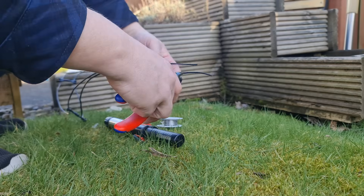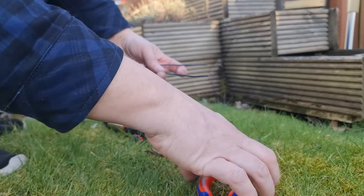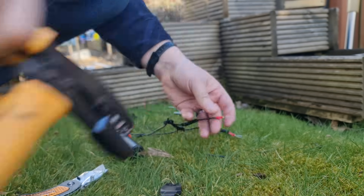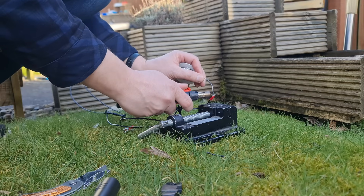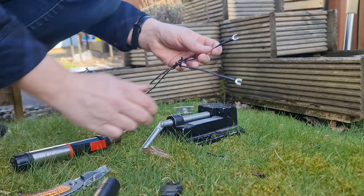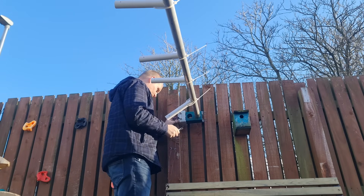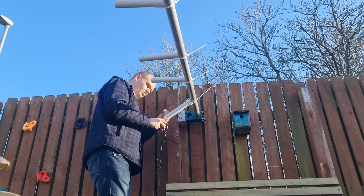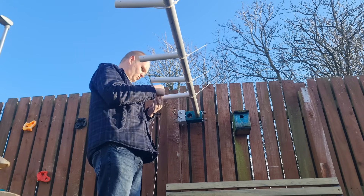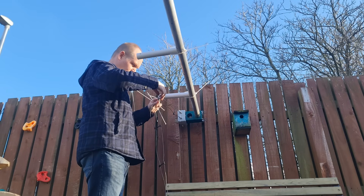Here's that open wire feeder. I just even one end off. I need to put ring connectors on it — crimp them on, and I also solder them using the flame for quickness, finished off with some glue-lined heat shrink, so that'll give it some nice weatherproofing. Using a 10mm spanner, connecting up our feeder. This took a little while — I think it took over an hour to get this run down the pole doing it for the first time. Certainly when I come to do it again and replace these for something UV resistant, it'll be much quicker and I'll be much better prepared.